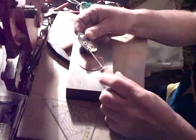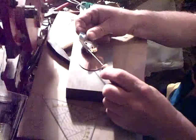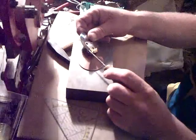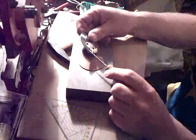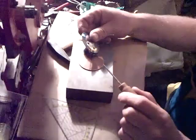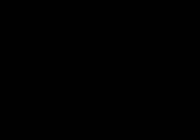When working with copper and brass sheet, you will want the rim a bit wider — this rim in copper should be 1.5mm minimum, maybe two, because the sheet is quite soft. In case of a very big fish or a bad snag, you do not want to deform or even tear the soft copper. Stainless steel does not have to have too wide a rim. So take care when using copper and brass — do not leave this rim too narrow. Now it's time to drill.